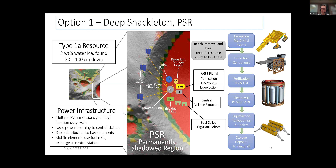Pneumatic excavation is good for removing regular overburden but not so good for mining ice. Our assumption — and it's an assumption until we get more ground truth data — was that the water ice resource was described as like coffee grounds and sugar: the regolith is the coffee grounds, and you have some little pieces of sugar mixed in, a fairly loose mixture. For that reason, we're able to excavate using different methods to pick up that loose mixture, make sure we don't lose the volatiles, and then extract the sugar out of the coffee grounds. We definitely need more ground truth data on what form the water ice and regolith are in.